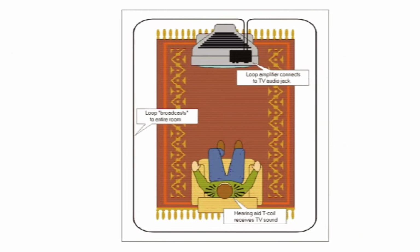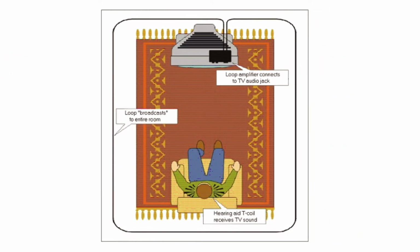The easiest hearing loop to install is a perimeter loop. The antenna is simply installed in a single loop around the listening area. The advantage to this style is the low cost allowed by the ease of installation. The amount of variation across the loop field is sometimes a deterrent depending on the width and the amount of metal in the structure. Consider the alternative methods later in this video if there is too much variation.